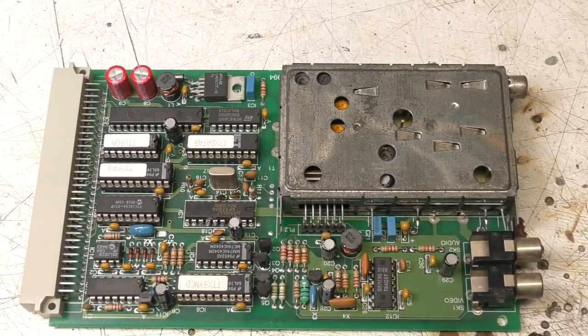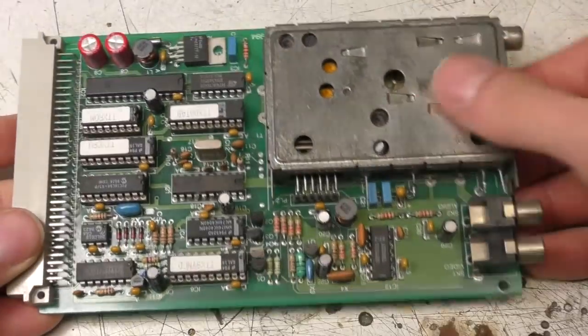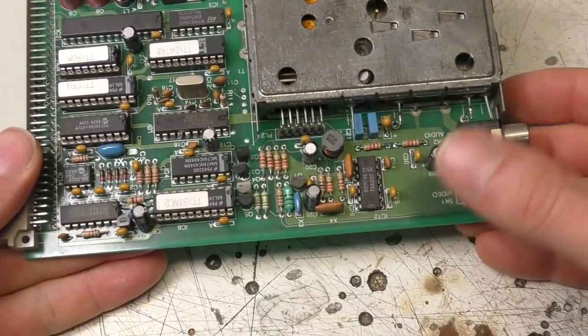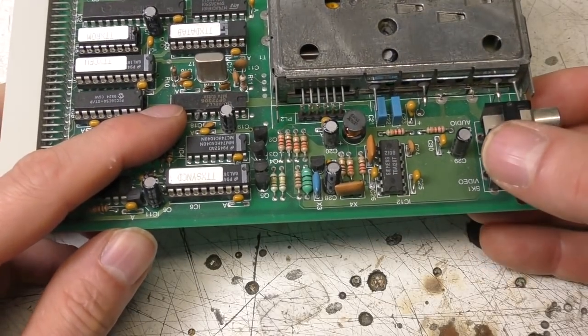From what I remember, the original BBC Micro teletext unit basically used a standard TV teletext chipset with dual porting of the memory, so it could request a page and then that page could just be copied into the Micro. This works slightly differently. I was looking around for chipsets. TV teletext chipsets tended to be quite highly integrated. But I actually found this is part of a two chipset set made by Texas Instruments.